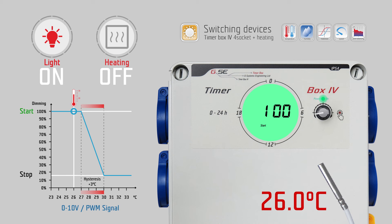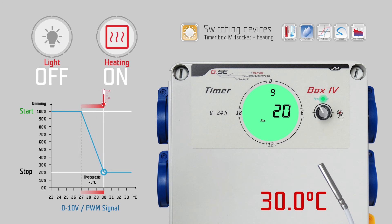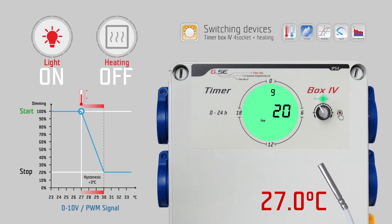Turn right for P8: max signal — push the encoder. Here you can set the maximal output signal in percent. Keep in mind this value cannot be lower than the minimum signal on P9. Push the encoder to save. Turn right for P9: minimum signal — push the encoder. Here you can set the minimal output signal depending on the lamp in percent; this value cannot be greater than the maximum signal on P8. Push the encoder to save. When the temperature rises and exceeds 27 degrees start temperature, the variable signal starts to dim from the maximum dimming percent of P8 until it reaches the stop temperature at 30 degrees, which corresponds to the minimum dimming percent set on P9. Meanwhile the sockets stop at 30 degrees and restart again at 27 degrees after the cool down time of P6 has elapsed.